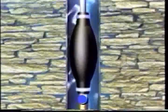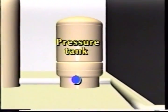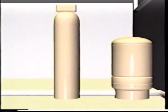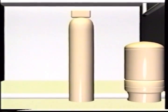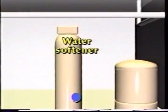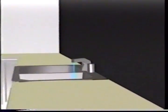Once in the well, the drop is slowly drawn upward toward the pump. It passes through the pump intake, is swirled around by the pump impellers, and pushed up a pipe into the house. Once it enters the house, it goes into the pressure tank, and may temporarily stop if the people in the house have turned off the tap. Now the tap is turned on again — the water drop flows out of the pressure tank, through any water conditioning equipment (in this case, a water softener), enters the plumbing system, and emerges at the kitchen tap: from aquifer to coffee maker in the space of a few minutes.